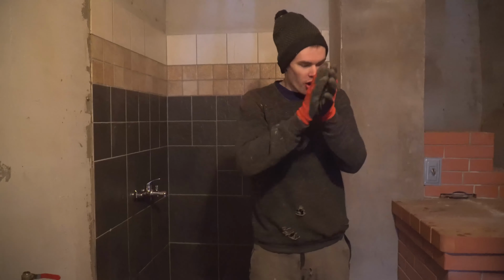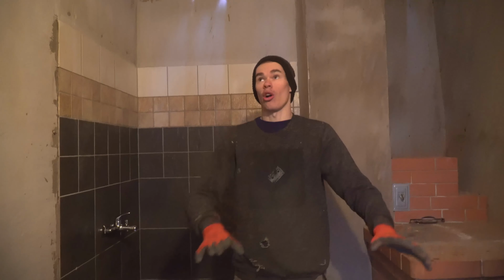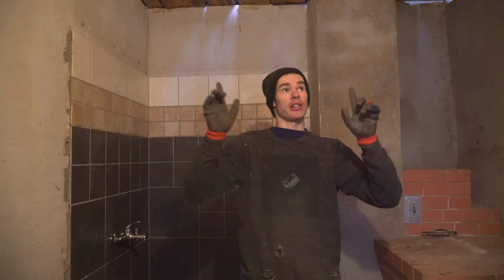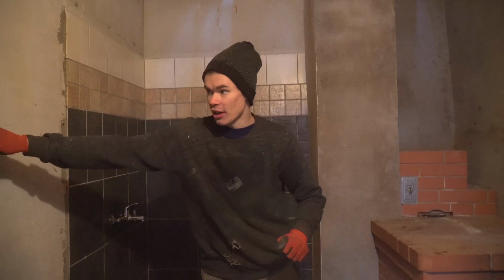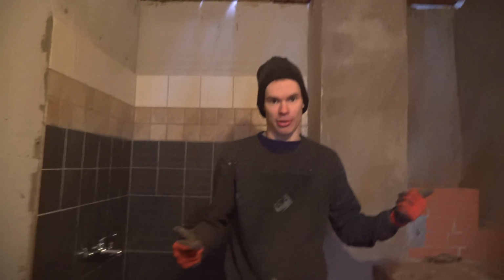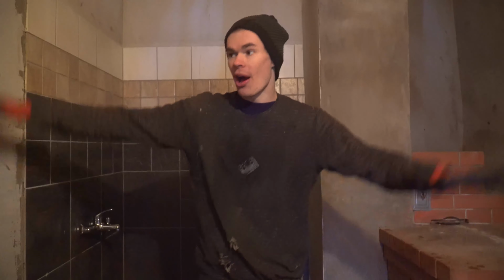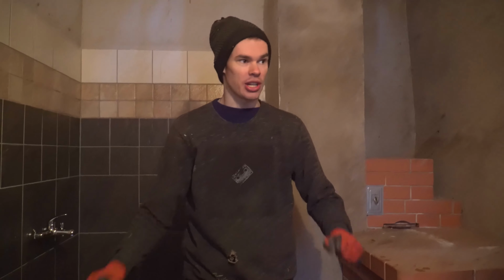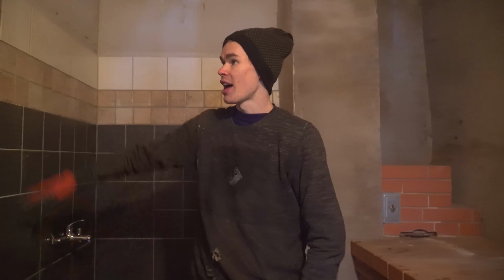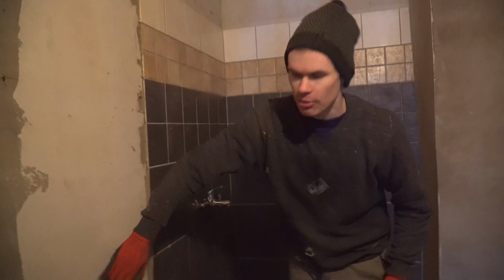So now we need to start off by vacuum cleaning the whole room, vacuum clean the walls, vacuum clean upstairs walls, and then the next step is to take out all these tiny nails, screws, whatever they are. Then we're gonna put primer on the walls, which is gonna harden the walls from anything falling off. Then we're gonna put spackle over them to make them nice and plaster.